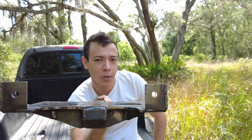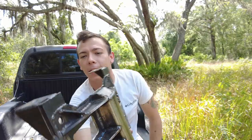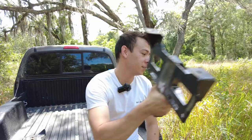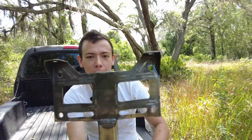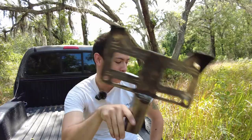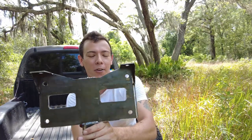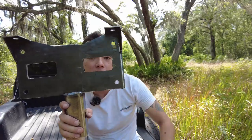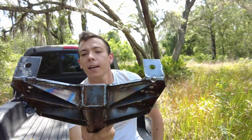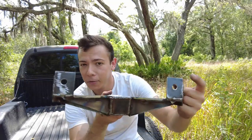At this point in the build I realized I had forgotten to make the fairlead supports, so I added some brackets on — but they looked janky, so I scrapped that version. I built a new one, but something went wrong with that one too, so I built a third. This final one is much beefier than the previous two iterations. There are significant design revisions: no window on the bottom for added strength, the top plate is 3/16 of an inch thick, the gussets node out to the base for greater strength, and I didn't forget the fairlead housings this time.